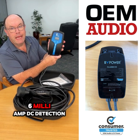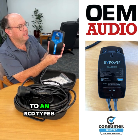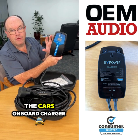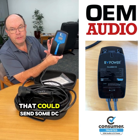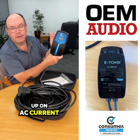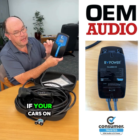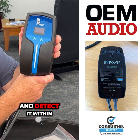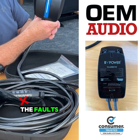We've also put in 6 milliamp DC detection, which is an alternative to an RCD Type B. If the car's onboard charger fails — which is highly unlikely — it could send some DC current back to the switchboard. Your switchboard in your house is set up on AC current and normally gets blinded by DC because it's not expecting it. If your car's onboard charger was to fail and it sent some DC, this device will stop and detect it within 0.3 of a second, so no harm will come to you. It's got a little display which will tell you the faults.